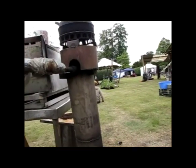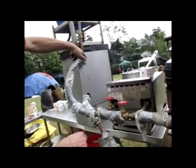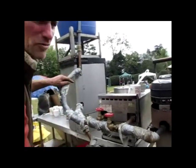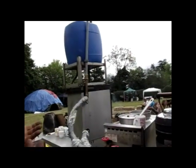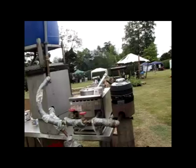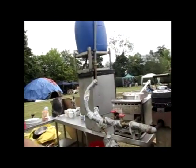Heat rises, hot water keeps going up. I can send the hot water through the bain-marie or straight into the tea urn. The cold water keeps dropping down. I've just set it up to keep itself filling itself. It's a demonstration of how you can capture the heat using hot water. You can have this going into a household copper tank — you can have that heat.